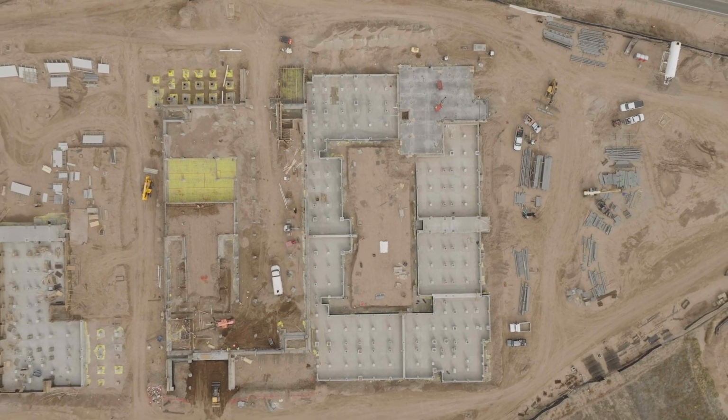And so it's taking what has traditionally already been a pretty strong HSS use case, because braces tend to be longer and more lightly loaded than columns, and it's making it that much easier by taking away any difficulties associated with that connection. And I think some of the innovation that comes from the connection is Atlas identifying the companies out there that are doing some of the innovation that obviously plays well with us. Whether it be a company like Cast Connex, which is doing some of the castings that Ted referred to, or some of the other single-sided bolt companies that are out there.